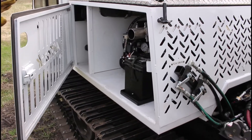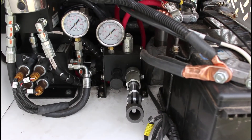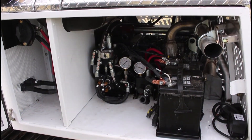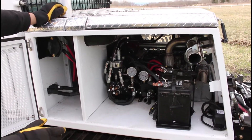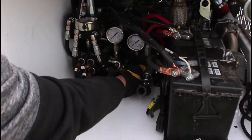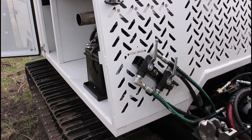Then open the driver's side engine compartment to find the emergency tow valve override. Turn the handle all the way to the left and pull it out. You can then pump up the pressure using a jack handle, a crowbar, or even by hand — it's quite easy to push. Once you get about 300 psi into the system, the brakes will be fully released and you can tow the machine. Remember: with no brakes in this position, tow only at a snail's pace — no faster than a walk. To go back to drive mode, press the button to bleed pressure, turn it back to the lock position, flip both handles back to drive, reinstall the lock bolts, and you're good to go.